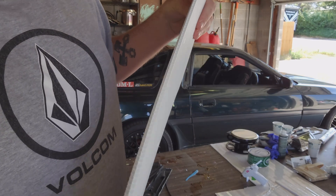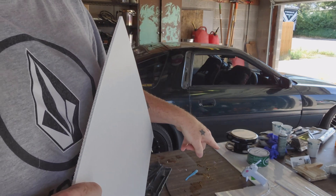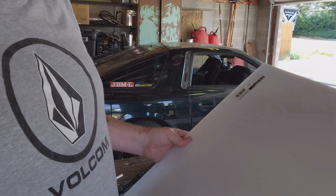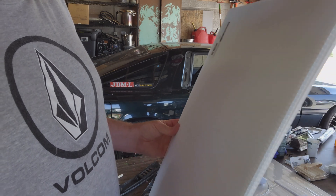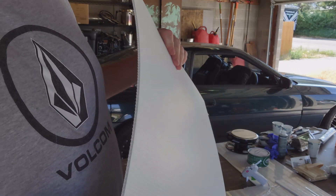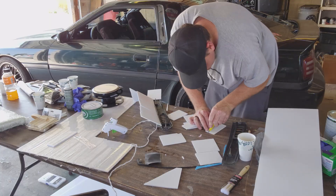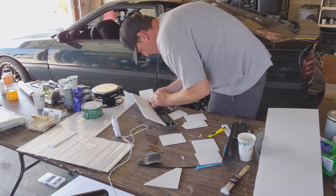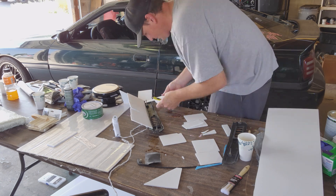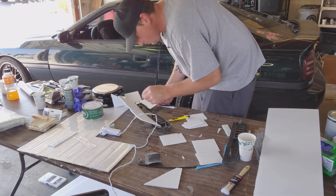We're going to go with this corrugated signboard. It'll mean I don't have to cover the thing with tape, and we're going to do pie cuts around the whole part so there's no spring tension trying to conform it to the part. Building this flange was probably the most unpleasant part of the whole project — it was just real tedious. You've got to make a flange all the way around the whole thing, cutting pieces so that you don't have any gaps.